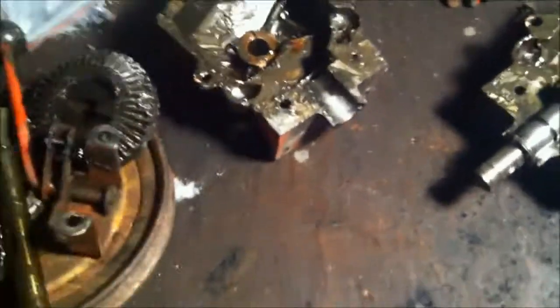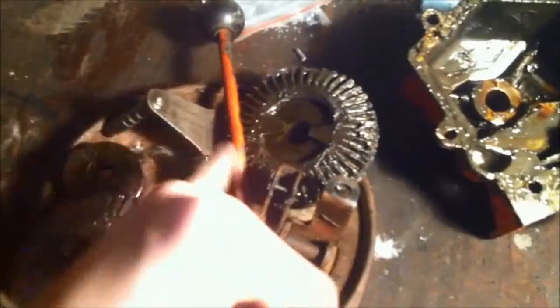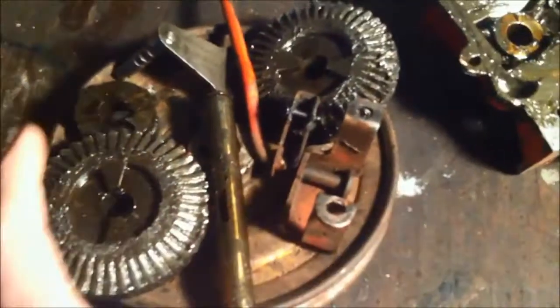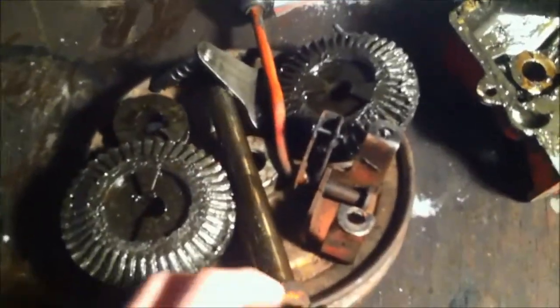So there's a whole bunch of metal in this transmission — a little unfortunate, but I have a couple connections I can just clean this thing up with. Here's the shifter for it. You just turn this, and that pushes the shifting lever in and out. Really simple gearbox here — right angle gearbox, about a 2.5 to 1 ratio. 7.5 inch pulley here. This is an 8 tooth sprocket pinion.